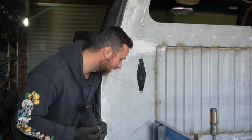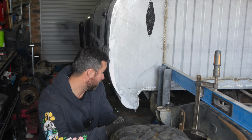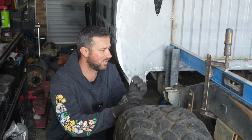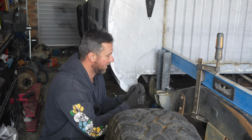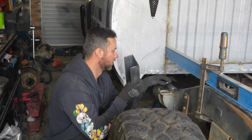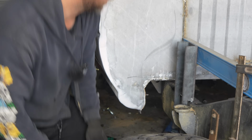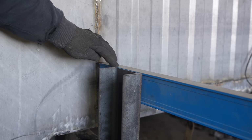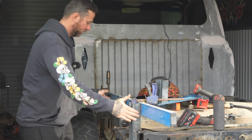This one here is like, I don't know, 3mm too low. So I've gone and got a couple of little washers, and we're going to use them as packers to get it exactly where we need. And that right there is perfection. Look at this. It's like 0.1 of a mil down. Wow. Beautiful. As you can see, all 3 are done on this side.